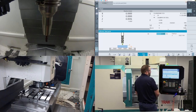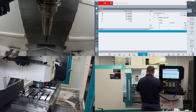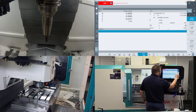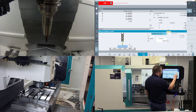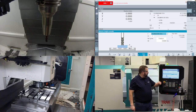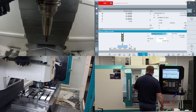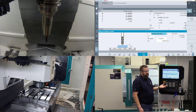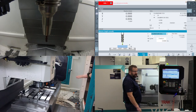Now when I go to measure any tool, I bring it up in Z — say 23 microns — go to 'measure length,' hit 'set length,' and it will update to my length on that page. That is how you calibrate using one of these plunger-style tools. This really makes life easy and is a great way to set your tool length. If you want to do it negatively, you give the distance from the table to there, and I've spelled that out in the document.